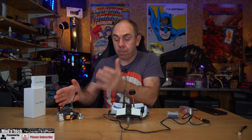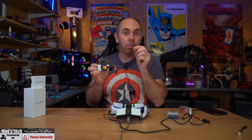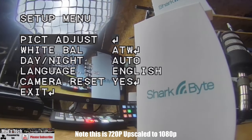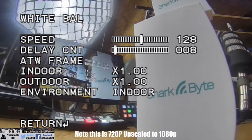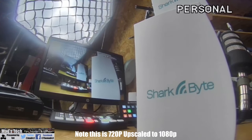On the air unit you have the option to change settings from within your sticks on your remote when connected to a flight controller, though I haven't been able to get that to work. Alternatively you can connect the little board on the back — it doesn't have to stay connected all the time, you can plug it in and unplug it as needed. Pressing and holding the joystick down brings up the setup menu, where you can flip the camera, change brightness, contrast, sharpness, hue, colour gain, white balance adjustments, day/night mode, language, and camera reset.